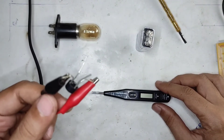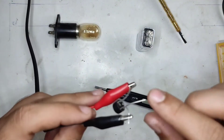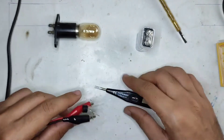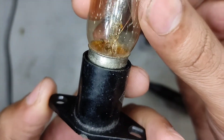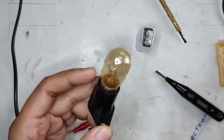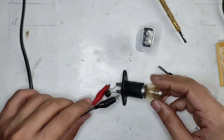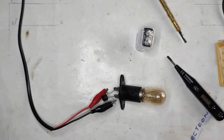It will work if I try to power it up with a rectified DC that has some reference to the AC. Here is my test setup: I've connected a W10 bridge rectifier — a 1000-volt rated 1.5-amp full bridge rectifier. As a test load, here is a 220-volt 20-watt light bulb, selected because it works fine on both AC and DC. I'll be connecting the full bridge rectifier to the bulb — the output DC powers the bulb.